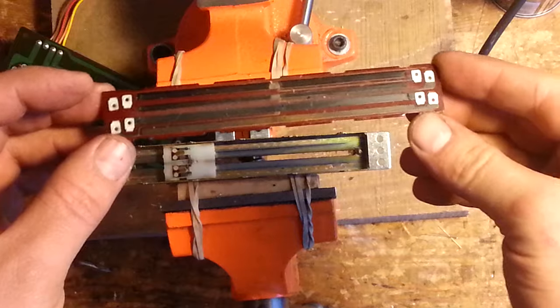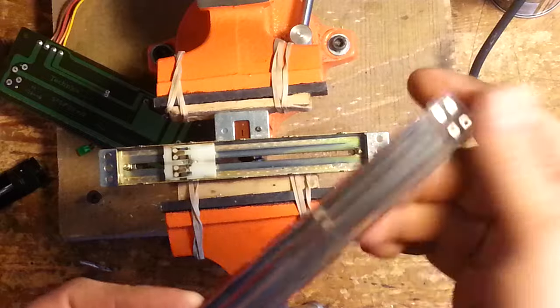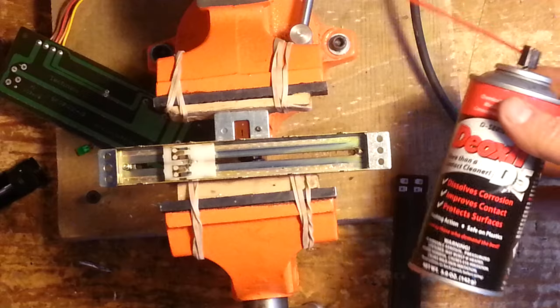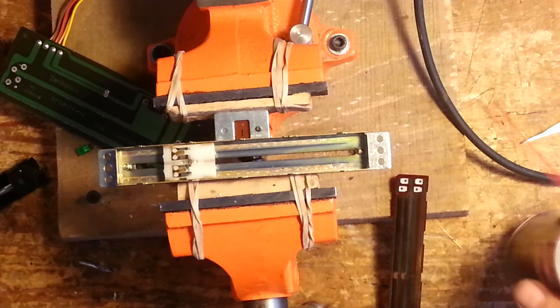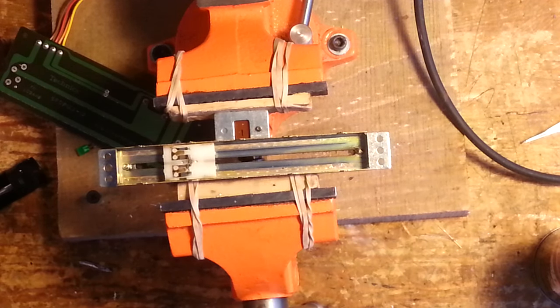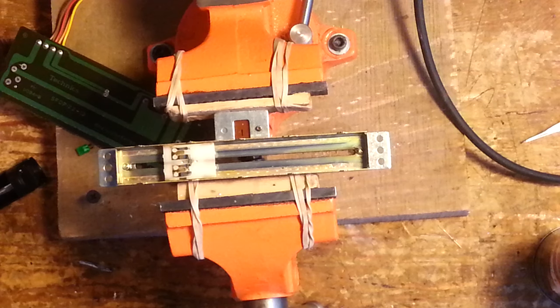If you look at that board, it can only go in one way, so when this fader inserts into the main circuit board it only goes in one way — that tells you the orientation. So we look at this pitch fader, it's a pretty typical amount of dirty. It looks like there's no damage, so the easiest thing to do is take a little contact cleaner — I use Deoxit D5, it's pretty standard issue stuff for electronics service repair. I'm just going to spray a little bit on the rag here and wipe this fader clean, get any grime or dirt off, and give it a good once-over.